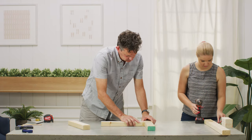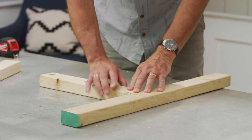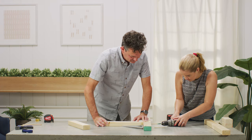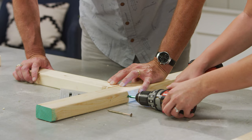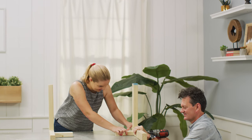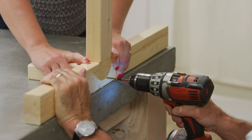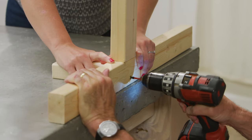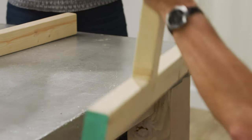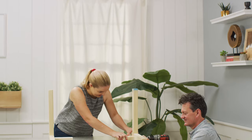Position a 15-inch upright perpendicular to a 28-inch piece just beyond the 11-inch mark you made earlier. Secure with 3.5-inch screws driven through the 28-inch piece into the end of the shorter piece. Add the shorter 6-inch piece at a right angle to the upright and secure to the 28-inch board in the same manner, making sure not to run into the previously placed screws. As you repeat this step with the other 6, 15, and 28-inch pieces, make sure you're creating a mirror image to the first side.